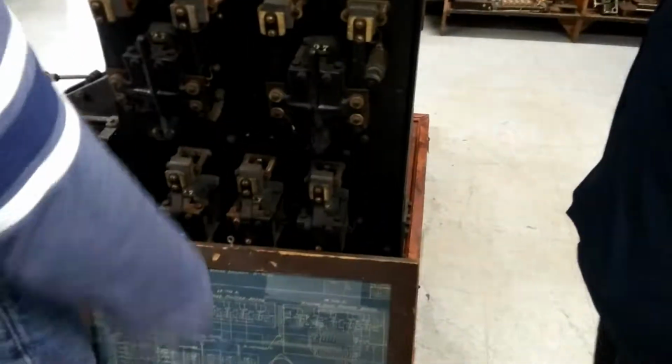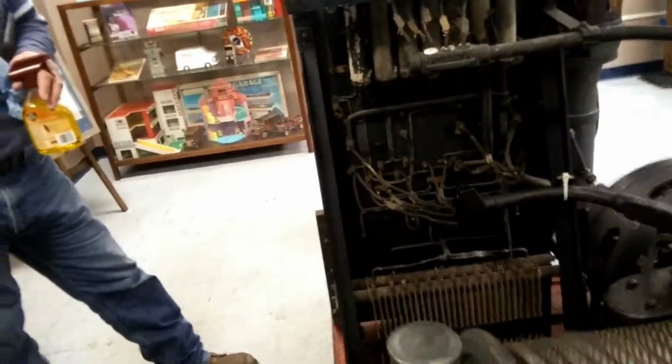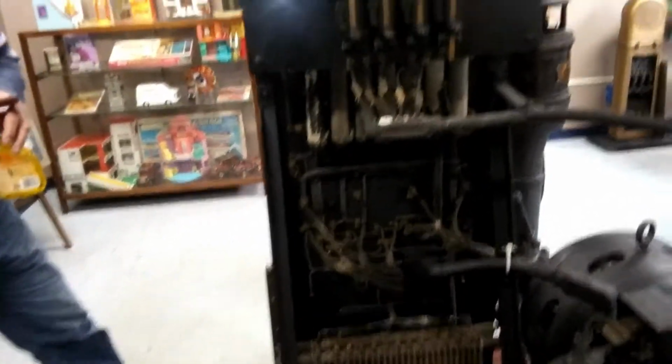Yes. Well, this controls them. This goes up and makes contacts here and pulls these relays in. And on the other side, this has 3 floors, and one of these is the door circuit. They're pulling when the door's closed, and these are all floor files. If you have this on inspection, I think you could actually run this off the board too, with the up and the down here, which must have been pretty dangerous. I've seen videos of these things. They like to shoot sparks when they disengage.